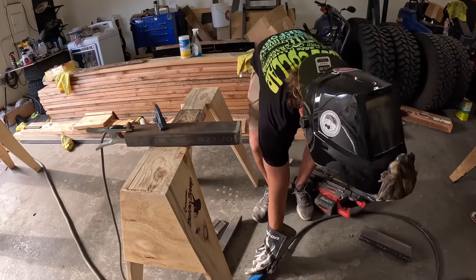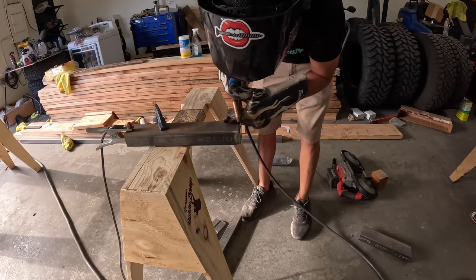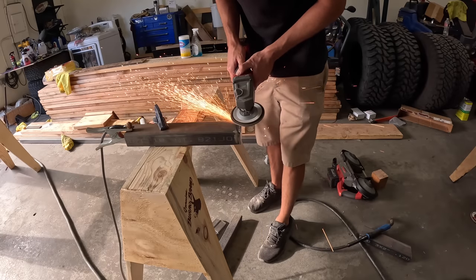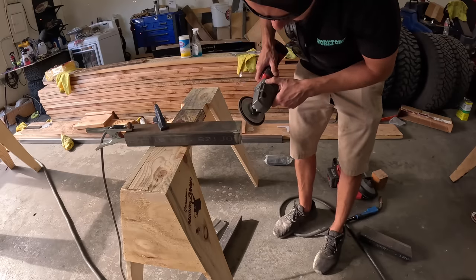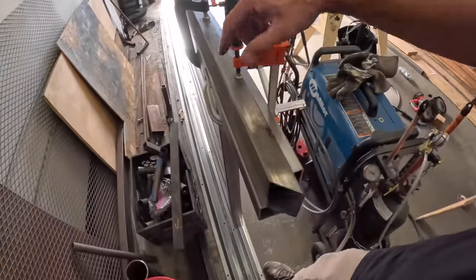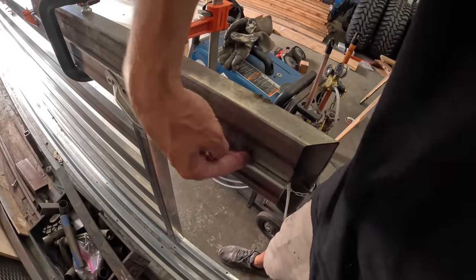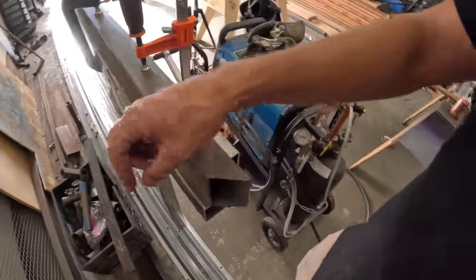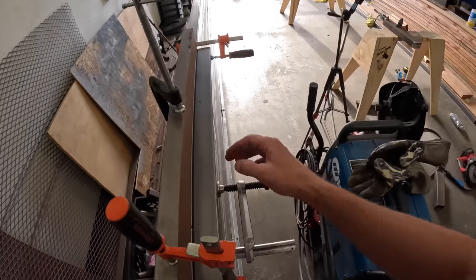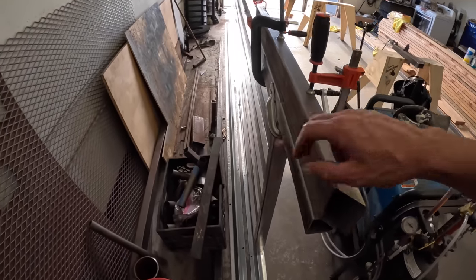I'm going ahead and putting the cap on this extension piece before I actually mount it on — it's easier when it's over here than sitting off the side of the gate. I've already done three sides, we're just going to seal up this top. I've got straight pieces run over the plane of this to ensure that the tube is in the exact same plane on both axes as the gate — that way it doesn't look funky or chatter when it enters the roller area.